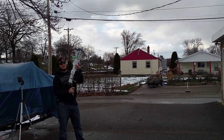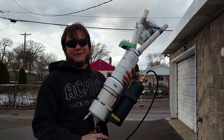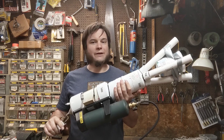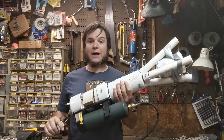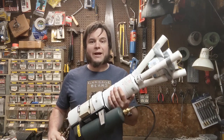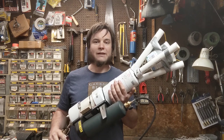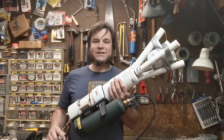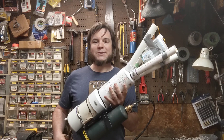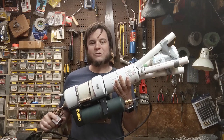Test number two — three, two, one. And it's on the roof now. I'm actually pretty surprised at how well this is working so far. I thought my angled barrels were going to be too angled and that the net was just going to tangle around itself, but it seems to fly pretty straight. Once the weights pop out and get out to the maximum length of their string, they just keep going straight. The thing that slows it down appears to be the air resistance from the net versus the weight of the projectiles or the strings tangling. I've tried a couple different weights in the projectiles — it still goes about the same distance, which I think is just aerodynamic drag from the net. So the next steps are replacing my duct tape and yogurt net container and then breaking out an actual drone to see if I can catch it.